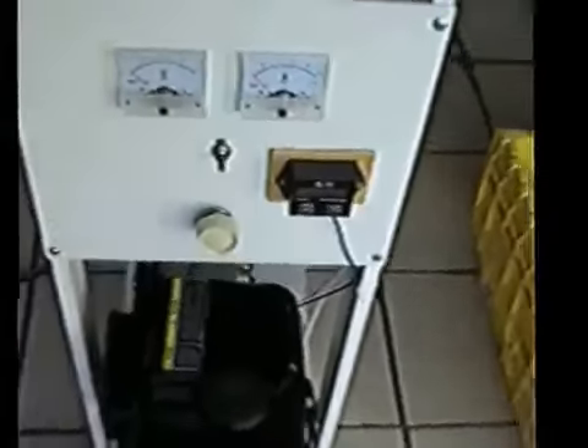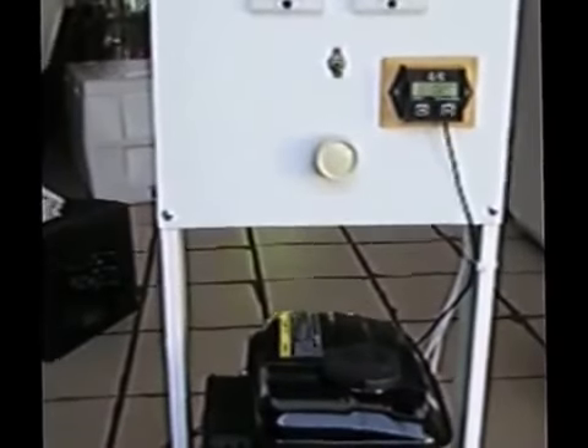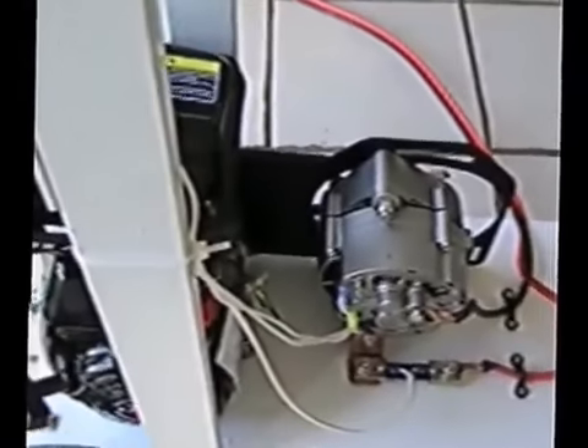You can see over here I've got an ammeter and a voltmeter. You can adjust the voltage output by the RPMs of the motor, and you can adjust the amps by the rheostat. The rheostat is running through the wiring. I should probably show you the schematic.